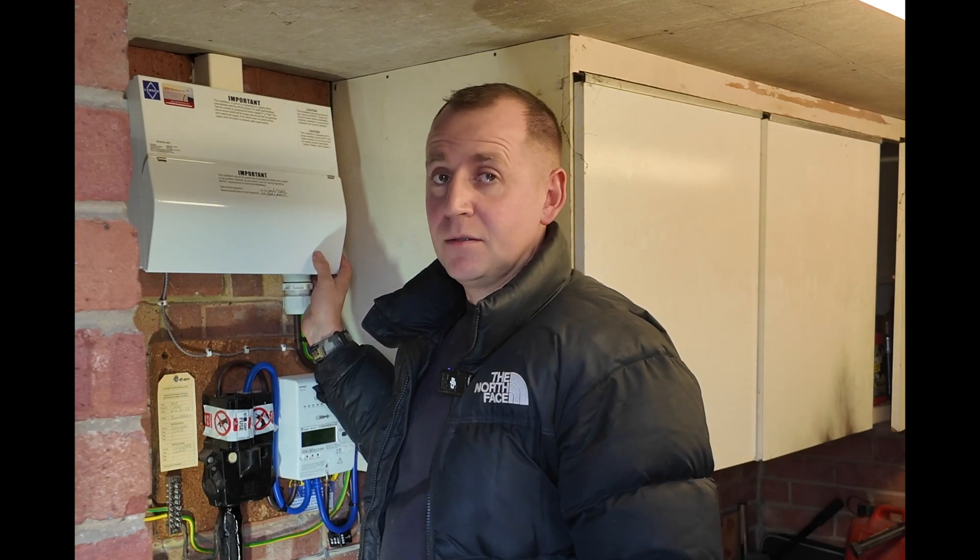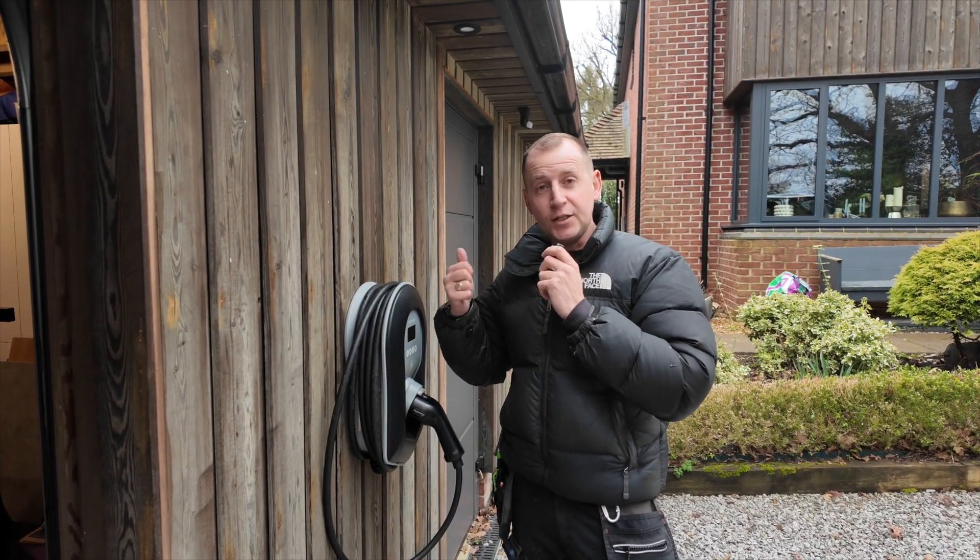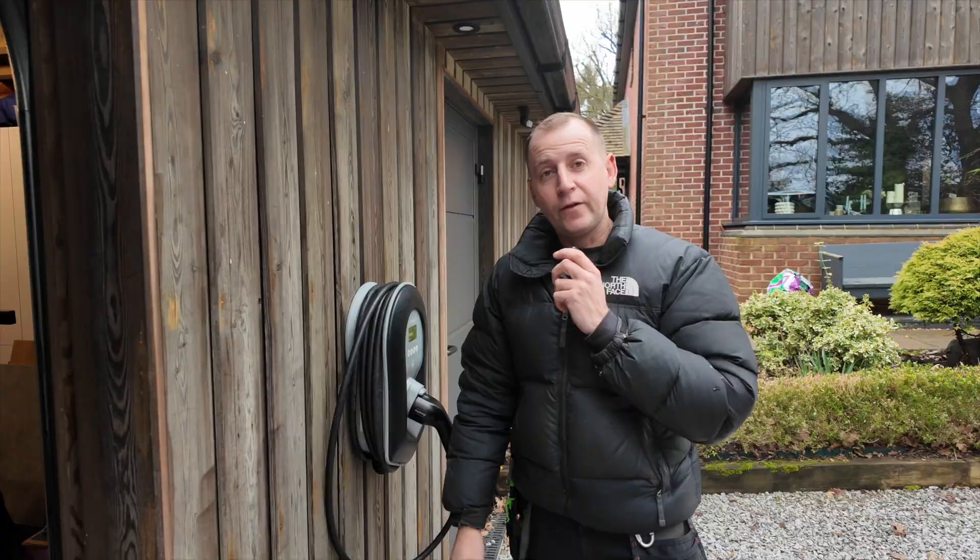That's the third install I've done with no RCD - ticking them off. Look, these rules and regulations in our game change like the wind all the time. By the time of recording this video this information is current, so I'm making this video really not to have a dig at MyEnergi or at any other installers - I just want to make you aware that if you are installing a Zappi or other chargers, it might be worth putting in an RCD upstream.